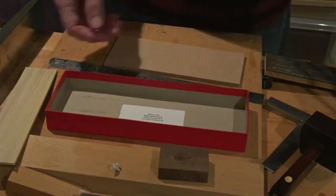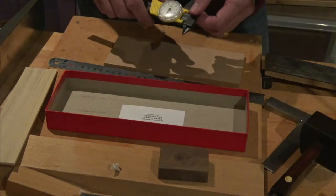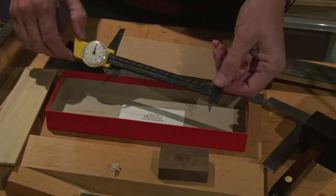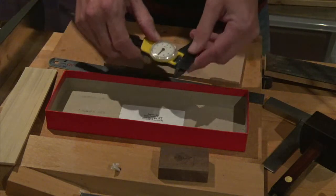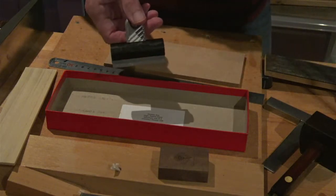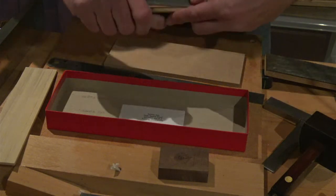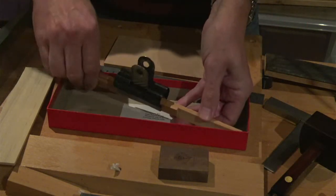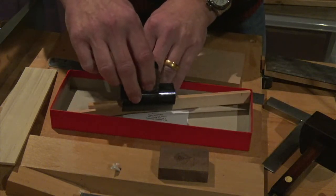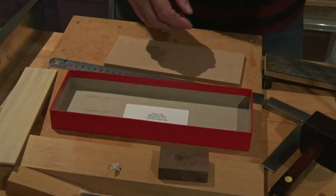Now, an easy way to do that is with a ruler, but in some circumstances you can't get a ruler in, you might have clamps all around it. Another way might be to use a pair of calipers if they're big enough for the job. And yet another way, take a bulldog clip like this, clamp a couple of little battens together, stretch them out inside into the corners, lift out and check the opposite diagonal. All those methods work, but it's always nice to have a new tool in the workshop.